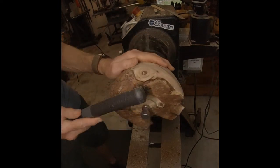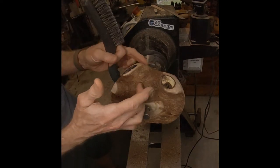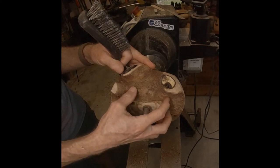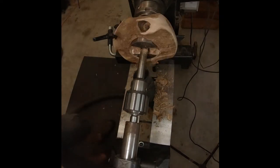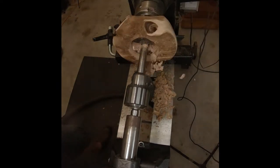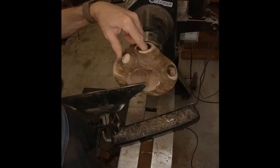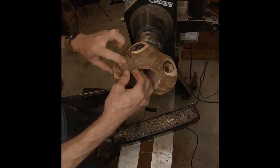When I machine the inside out, I'm going to have to be careful — I want to make sure I leave enough meat here that this holds that ring in place. So I may end up with a small hole in the middle as opposed to a great big thin-walled bowl. I'd like to maintain this nice hole in this one and this branch, so I'm probably going to hollow it out enough to leave those connected together.